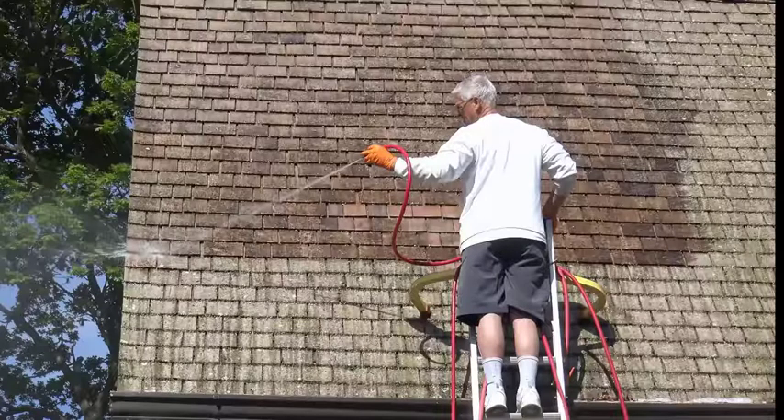Now let's get to the rinsing part. As you can see, I'm standing on a ladder, not walking on the roof, and I'm using garden hose pressure — never a power washer. You wouldn't want to use a power washer on wood cedar shake roofs. As you can see, there are a lot of infestations — these shingles are engulfed with moss, lichen, brown rot fungi, and mildew. I've already rinsed some sections and I'll rinse everything down again when completely done removing everything.